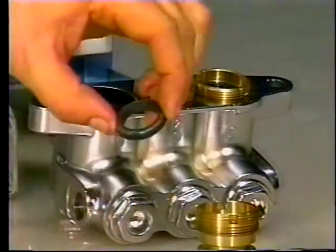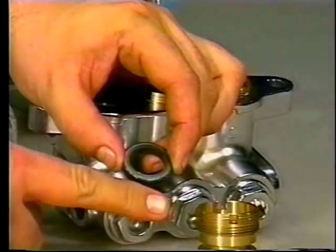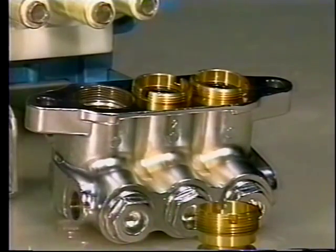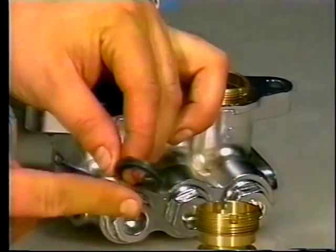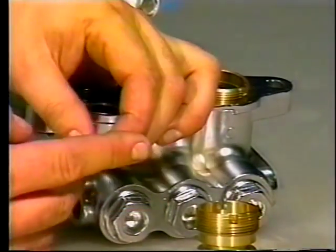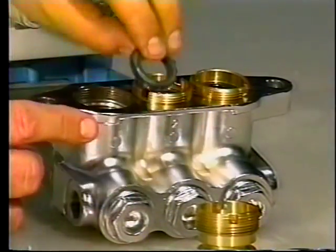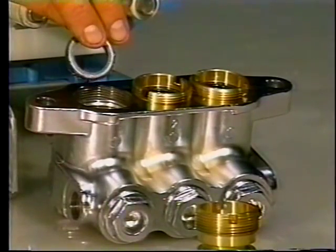On the standard plunger pump, examine the high-pressure seal for frayed edges or normal wear and replace. Apply liquid gasket to the outer surface of the high-pressure seal. Then press it into the manifold chamber until completely seated with the metal backside up.